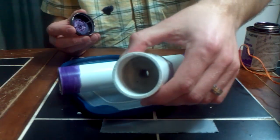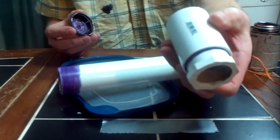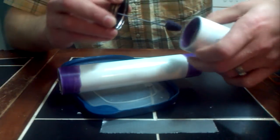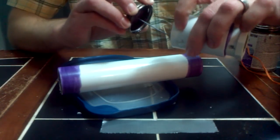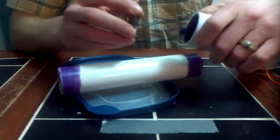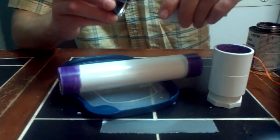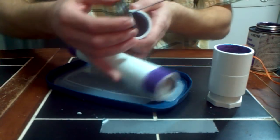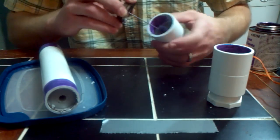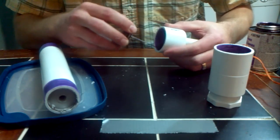Go ahead and prepare your nozzle. This is how our nozzle turned out — very nice convergent there, divergent with a bell as well, and this is right at the 5/16 inch diameter. In the next video I'm going to show you the static test of some of these motors that I've built. We'll also go over a Bates grain calculator, because that is very, very important. The washer that you use for the nozzle diameter should really be based upon how much pressure and power you've designed this motor to be. A Bates grain calculator is invaluable — without it, it's guesswork.